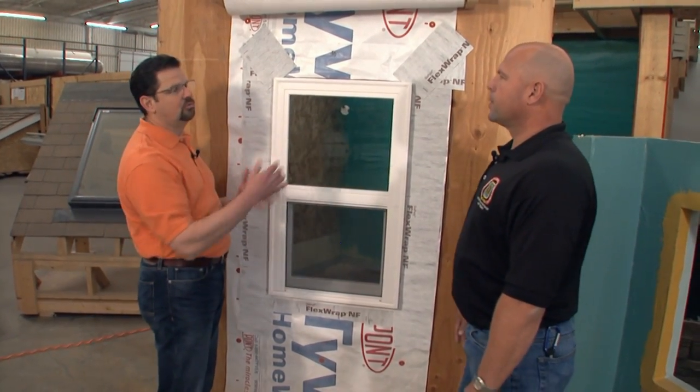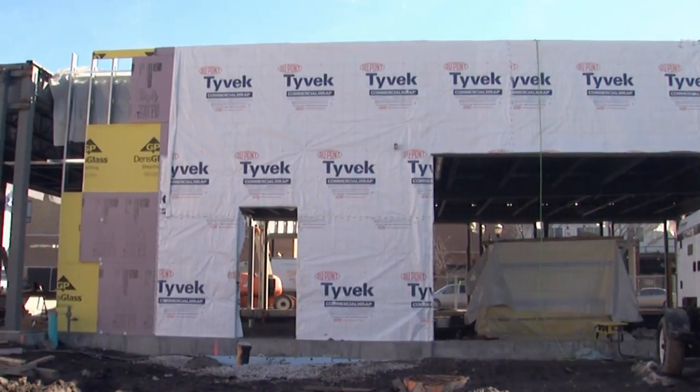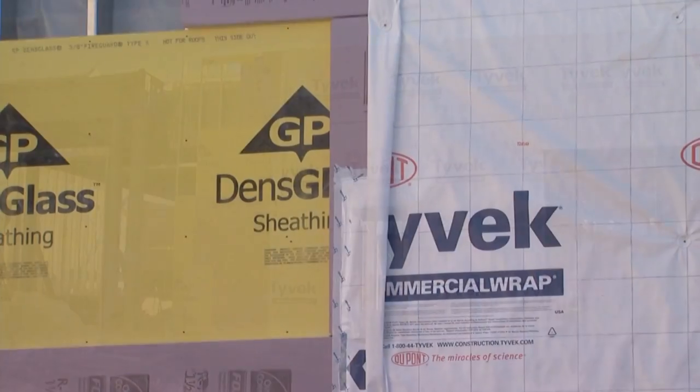So we go from a multi-step process to virtually a single step. Whether you're a masonry or siding exterior, moisture always gets in to some degree — it's a matter of how you manage it. We talked about different management planes: heat management — the thermal component — and air management. Air movement in and out of the wall can be as disastrous as a lack of insulation, because you're transferring large volumes of cold air in and out of your building. So the air management layer is very important. And then moisture management — whether that be bulk water, like behind siding where we used to use tar paper and now use building wraps — and in some cases managing vapor as well, depending on the permeable and non-permeable technology available.